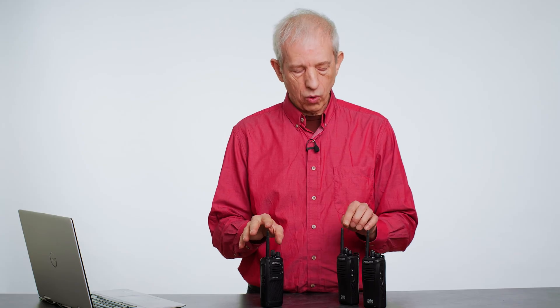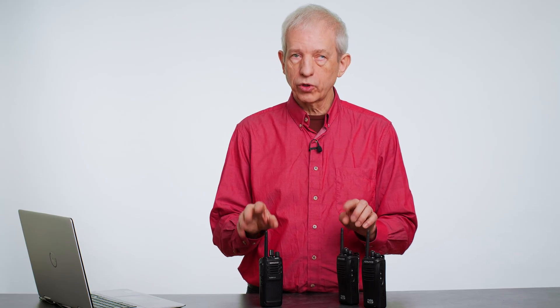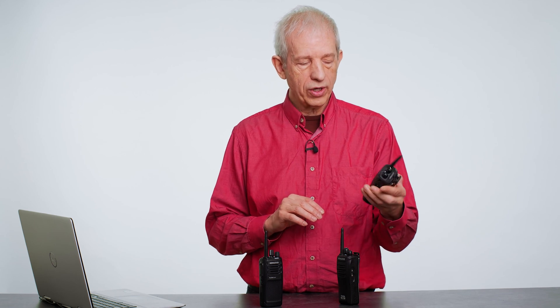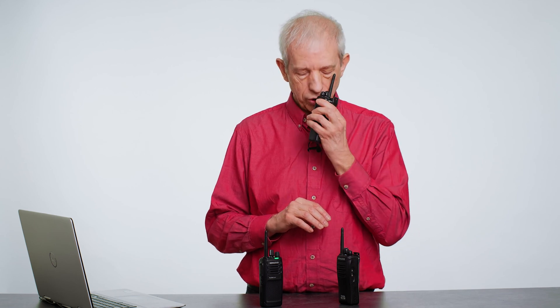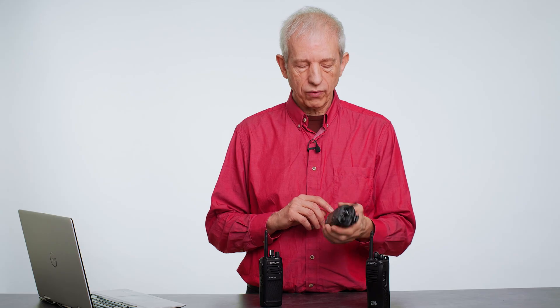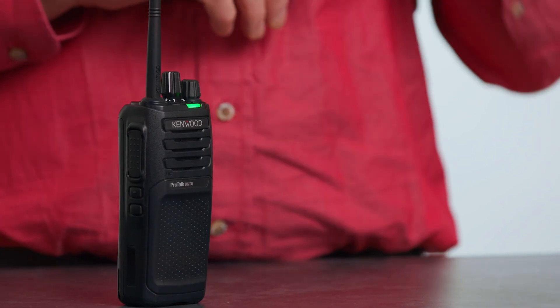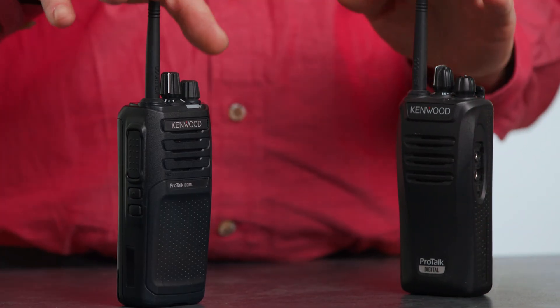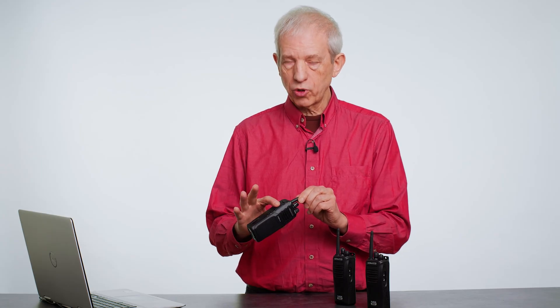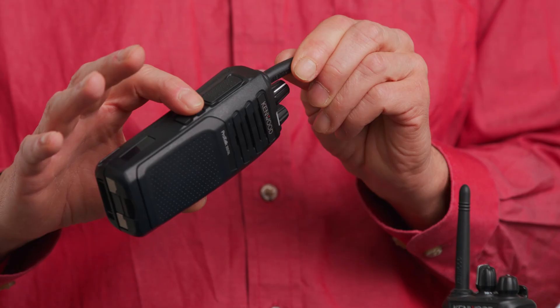In the reverse direction, when a call comes in the radio will automatically switch between the two modes. Calling with this radio — one two three four five — that's a digital call. When that call is finished and someone on your analog fleet keys up, you can hear that call coming through. No action needed on this radio. All you need to do in the normal way when a call comes in is push PTT to answer. You don't need to use a second PTT.